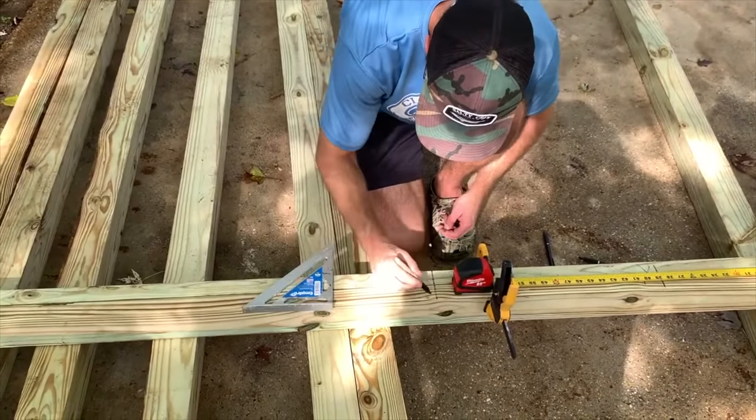So at this point, we're gonna be doing some work on the inside of the shed, and the first order of business was to install an outlet. So what I'm gonna do is I'm gonna take the power feed cable that's coming in at the bottom there, and I'm gonna route it through that receptacle box, and I'm gonna install an outlet there. Next, I'm gonna take the power cable from the outlet box and I'm gonna install some exterior switches.